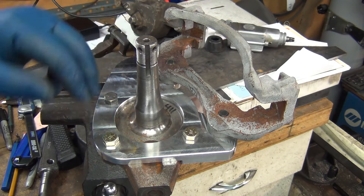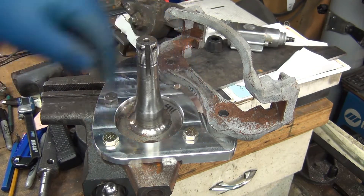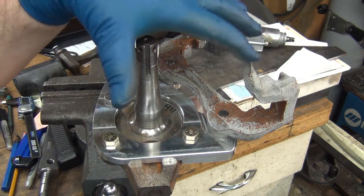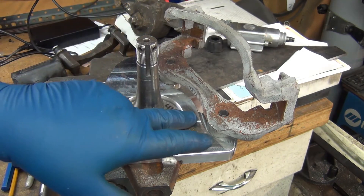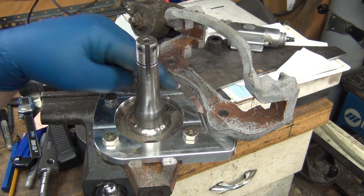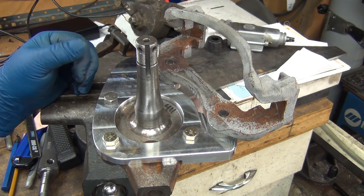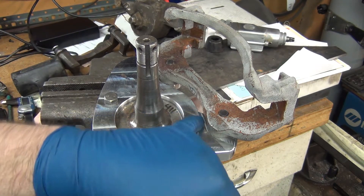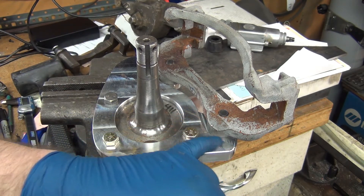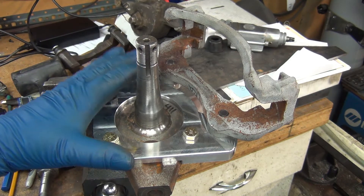Now that I'm looking at it — because I tried to draw along this using an image when I did the CAD work — now that I see the islands, I can go in and add some more meat around those standoffs. That's a big plus, because this one down here gets a little thin, so if I can get some more meat out there, I'm tickled pink with that. I'm extremely happy with how that fits.